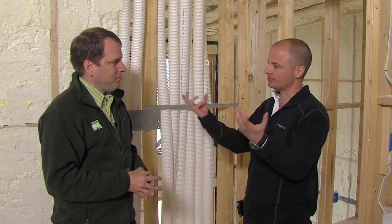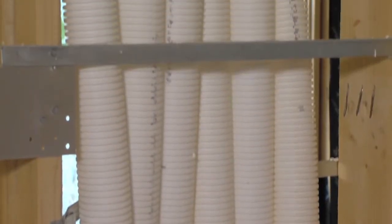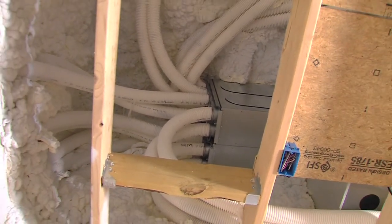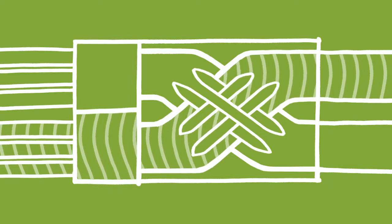How does an ERV work? Nobody knows. No, actually it's very simple. You want to draw air from a clean source — the outside — into your home, and you want to pull the stale air from your house to the outside. The piping that you see right over here is how we're distributing that fresh air or exhausting that polluted air to the outside. Everything comes together into what's called a distribution chamber, which is next to the ERV. The two-channel ERV pushes the stale indoor air out one side while bringing fresh outdoor air in the other.